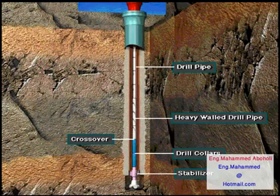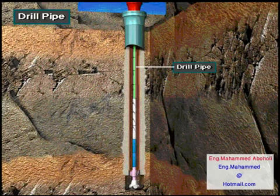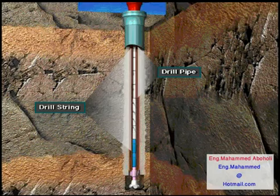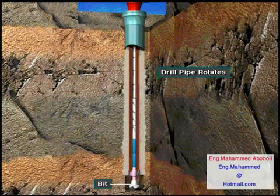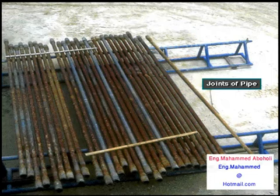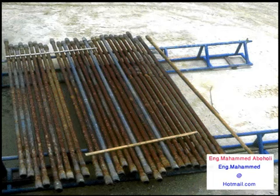There are many components which make up the drill string, as shown in this graphic. Drill pipe is strong but relatively lightweight pipe. Crew members attach it to a top drive or Kelly. Drill pipe forms the upper part of the drill string; usually the drill pipe rotates, which also rotates the bit. Each section of pipe is called a joint. Crew members screw together, or make up, several joints and put them into the hole as the bit drills.